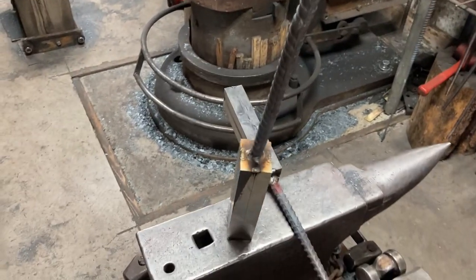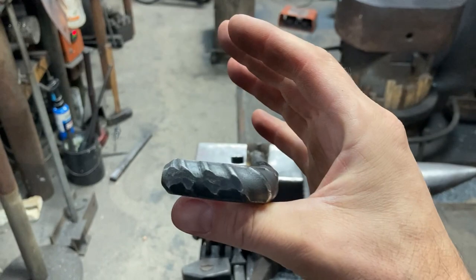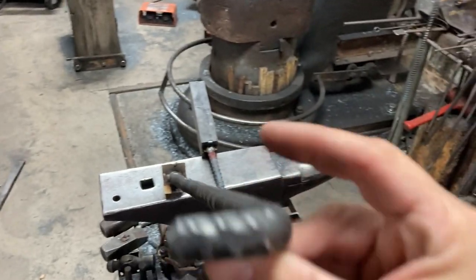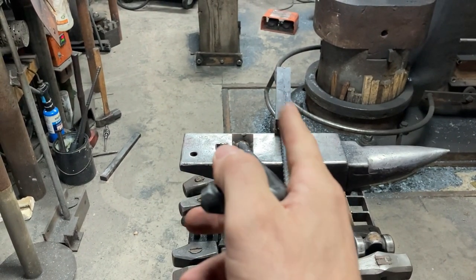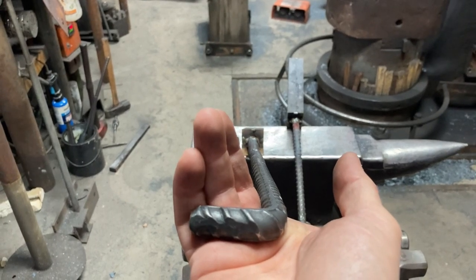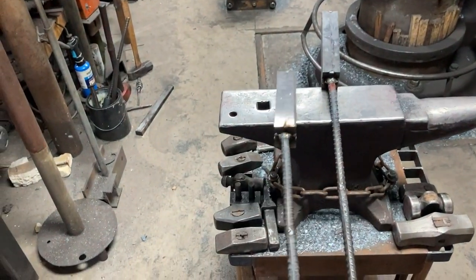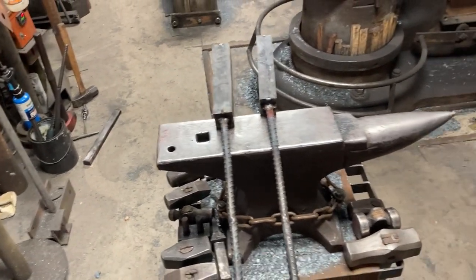And I have positioned the handles on these so that the bent tail of the tang here is aligned with the horizontal link of the chain, just for an easy reference to keep in mind. As long as I keep this flat during forging or perpendicular to the bottom die, one or the other, I won't be hopefully clocking my billet erroneously inside. So into the fire we go.